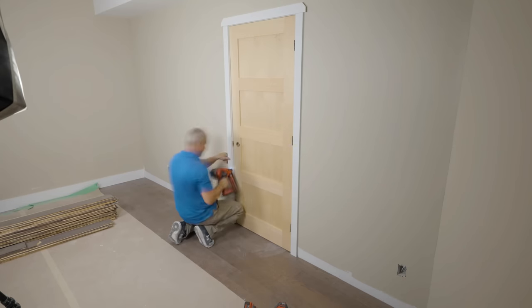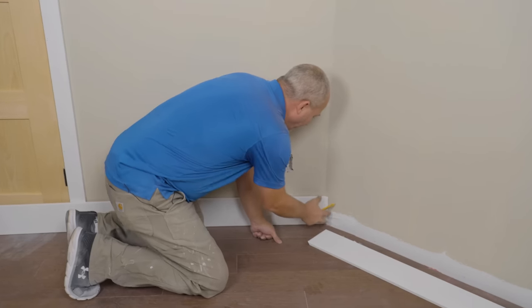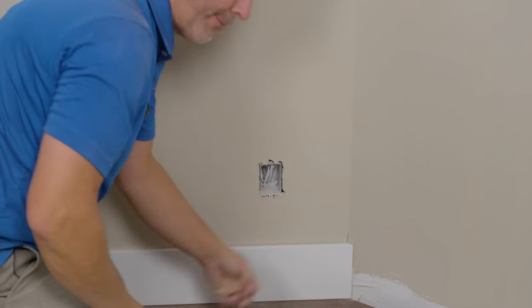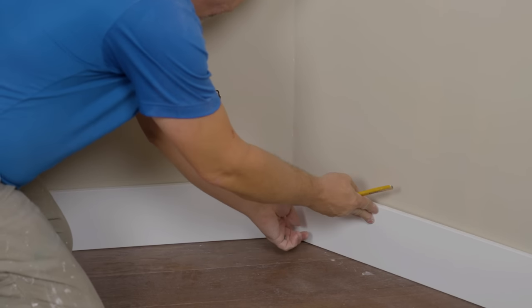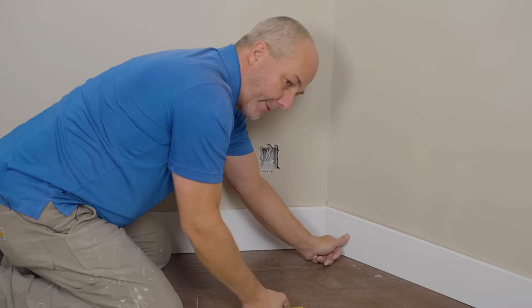We're going to show you the baseboard technique — inside 45 and outside 45 — and show you a couple of different miter joint tricks. Because we don't have to miter the casings, but if you're going to trim out a room, you're going to need a miter joint sooner or later, unless your room is literally just four walls and no outside corners. Here's our corner — it's a 45. The trick to getting something close to perfect, and it's impossible because of the mud and the joint, is you want the backside of that joint in the groove. If you take a 45 on the backside of both pieces and just overlap them in the corner, that's all you need.